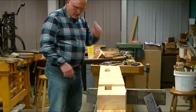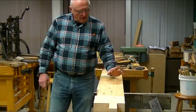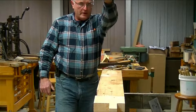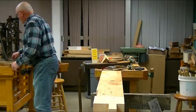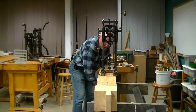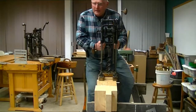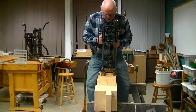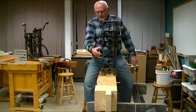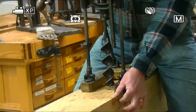Next thing I want to show you — this right here is a brace pocket for the plate. You can see where your plate is going to come on this tenon. The brace is going to be on a 45-degree angle going up, so I'm actually going to drill a hole there. I'm going to use my Miller's Falls boring machine, circa 1880-1890. This is a two-inch mortise and I'm using a two-inch bit. I have this depth set — this is the depth stop. It's a four-inch deep mortise and I've got about a five-eighths inch housing on the side, so I'm approximately four and five-eighths inch deep.